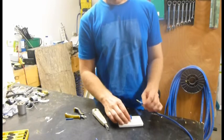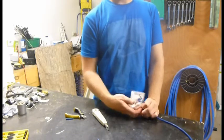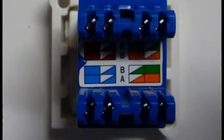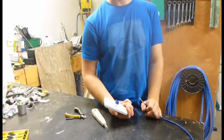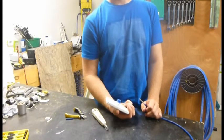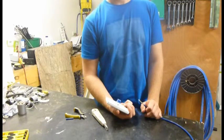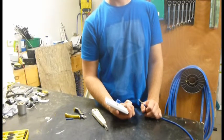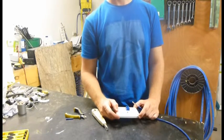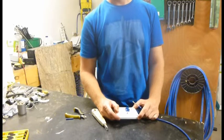One end of your cable will terminate easier than the other. In the back of the jack it'll say A and B type termination — use the A. For the most part, people who terminate with the B type are stuck in the past; it's left over from other technologies. The only time you'd use A and B is if you're making a crossover patch cord, but if you're making a patch cord you're wasting your time — you can buy them so cheap online. By the time you pay for the materials and your time, just go and buy one.